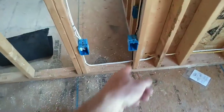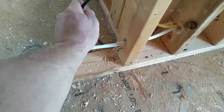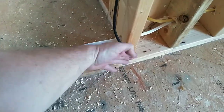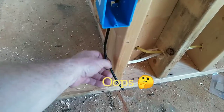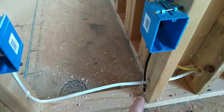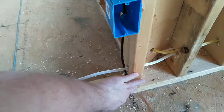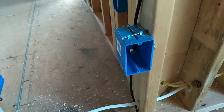Put a staple at the bottom to hold the wire. If you don't install this staple, the drywallers will put the sheetrock up and that wire will get pinched behind it. You'll reach your hand into the box to pull it out and find yourself in a predicament — it's stuck, pinched good by the sheetrock. You'll rub your hand down the wall, feel a lump, and know they've pinched the wire. Recommendation from Ron Doyle: put a staple at the bottom, loose enough that the wire will still pull out when you go to do your connections.